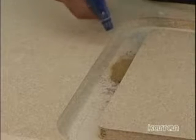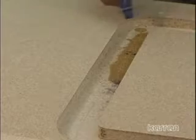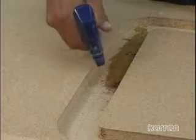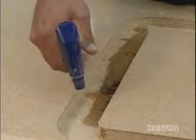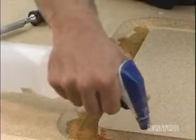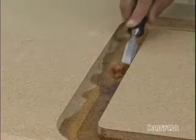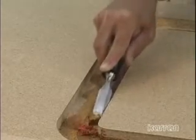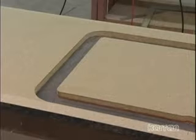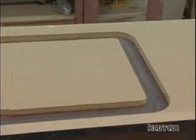Carefully wipe or spray the remaining particle board with a solvent such as lacquer thinner, toluene, or other adhesive remover. Be careful to keep the solvent away from the outer edge of the cutout. Let it soak in for a few minutes. Use a sharp 3/4 inch to 1 inch wide chisel to remove the remaining particle board. Clean remaining adhesive off the back of the laminate with a solvent and clean rag. A wire brush can also be useful. Spray clean with compressed air.